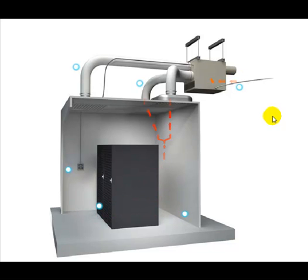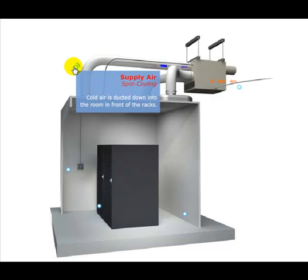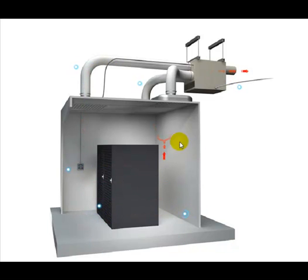Here you're looking at a ceiling-mounted unit. The Cool Cube is mounted above the server room. The condenser airflow comes in through the back of the unit. Then you have your supply air — your cold air comes down, flows in front of the server rack, gets drawn in through the rack, and then out the back. The return air goes in from the room, from the back of the server rack, and then goes up and comes back out. This is a typical ceiling-mount application. Thank you.